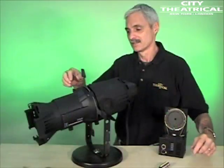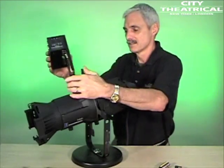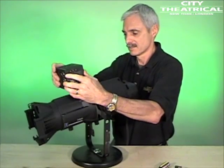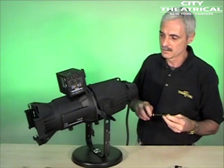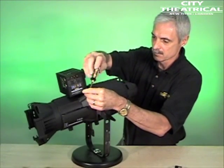Please consult the user's manual on our website for full setup and operating information. To insert the DMX iris into the lighting fixture, open the iris slot and remove the cover, saving the screws, and drop the iris in. It is a tight fit, and it's easier to insert if the iris is fully closed. Tabs on the iris allow it to be screwed to the lighting fixture for safety.